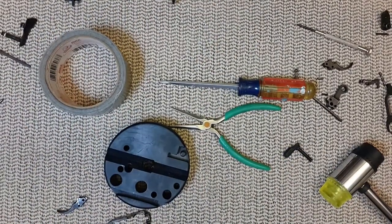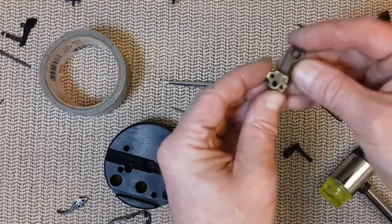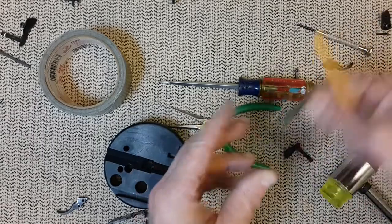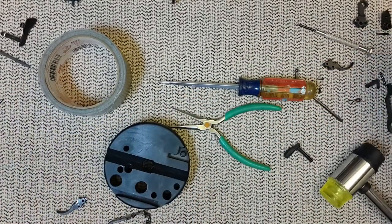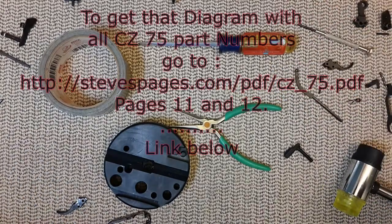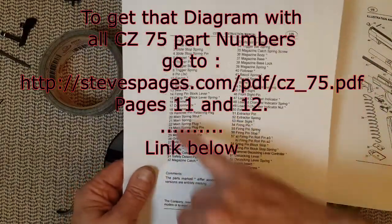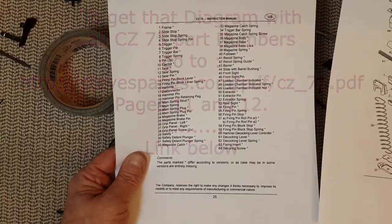But you will be surprised — a lot of things fit. What does not fit, I can tell you, there are only a few parts and they can be trimmed. This is a CZ hammer and if you want it to fit on the Kanik, you will have to enlarge that hole here. Pins are interchangeable; many things are interchangeable. The trigger springs, being different, will still work and almost everything can be swapped. I have a list — I suggest you download this from the internet because I'm going to take that list with the number and the name and tell you if it fits. It will be a yes if it fits, a no if it doesn't, and what is required if you need to do something about that part.